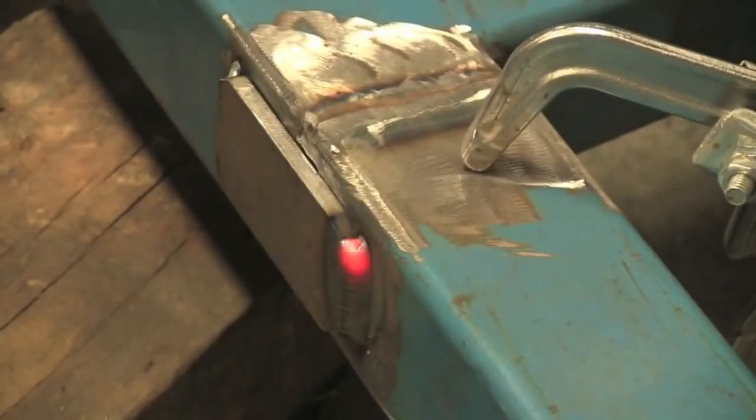And this is just everything I'm asking this little 115 volt MIG to do, everything it can do. But it actually did a pretty good job. The member on the right hand side is only 1/8 inch thick, so that's really all I got to worry about, even though the doubler is a 1/4 inch thick. So doing these little uphill weaves like this actually did pretty good. If I'd have had a long stick out because of that wire or the contact tip being way up in the nozzle, it wouldn't have done as good.